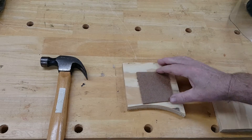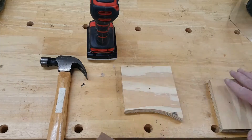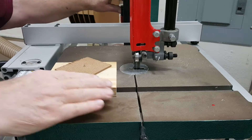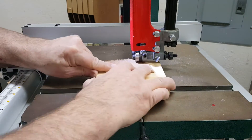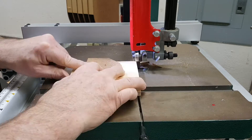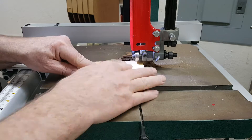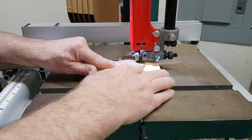I used one-eighth inch hardboard for the insert. I cut a small piece from some scrap and drilled a hole in the middle of it to go on the pin. I would make consecutive passes through the saw blade, turning the piece a little each time until it had roughly a circle shape. Holding the jig still and very carefully spinning the piece smoothed out the final roughness.